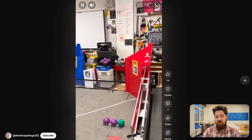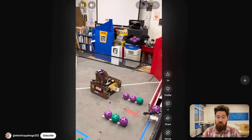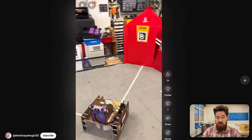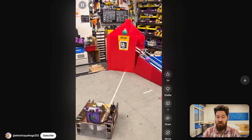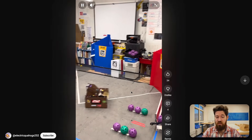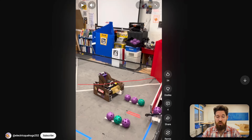Another really interesting section on this robot — it's able to index, very impressive work. Take a look at how their shooter ends up working: they take a little pause, pick it up, move it in, and they've got a little lever arm that is kicking it up into their flywheel. Another thing teams can think about in this launching is where along the launch line you decide to rest your robot to actually do its shooting pose — you want to think about where's the most efficient place that you can drive to add up extra time, because the shortest path is going to get you the most time inside of the autonomous section.